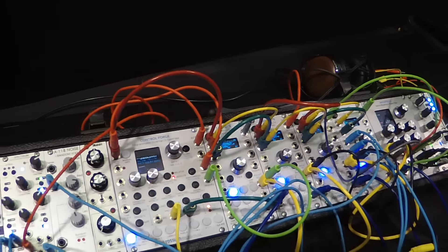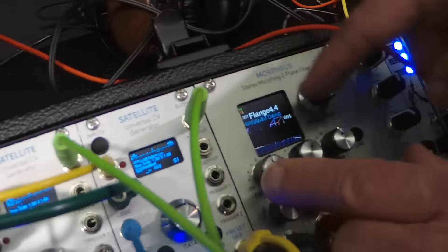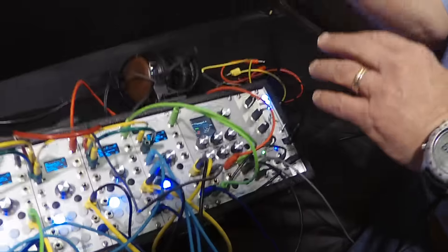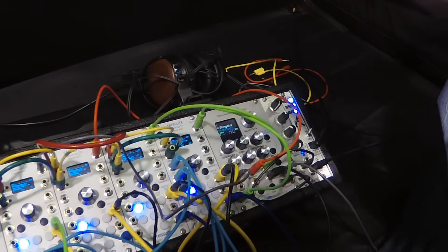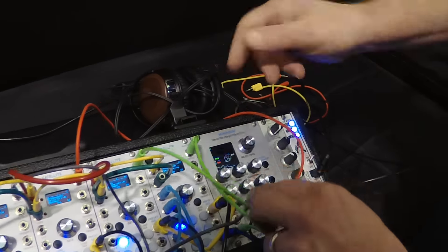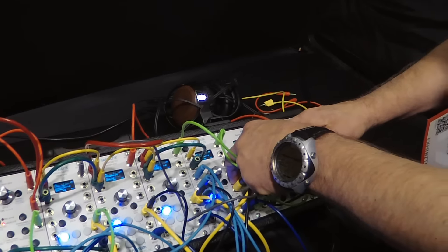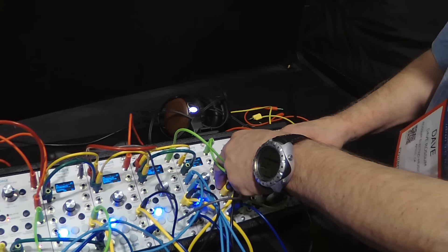Right now we're starting with no sound, but just over here you can see the display of the Morpheus. One of the neat things Morpheus has is a real-time frequency response display, so you can see the sort of frequency responses we can get out of a 14th-order filter. It's got seven resonances and seven notches in the frequency response. What I've got up here is a flange dot four — if I put a little noise through it, you get some nice flanging, notchy wind noises.